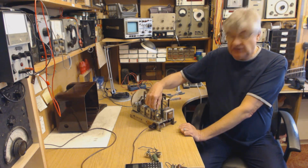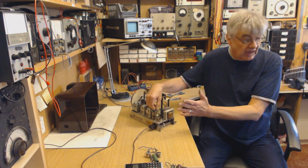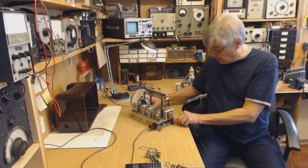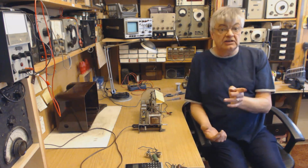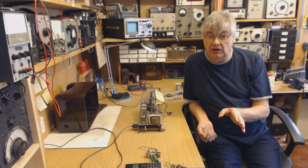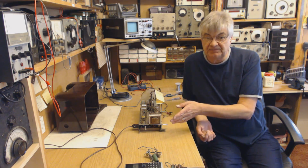So okay, there's another problem. The UL41, you know, the UL41 that all the DAC90As have, and they often have a problem with hum. Well, I found an EL41, okay, 6.3 volt heater, same valve. One slight problem, pin 4 I believe it is, I'll go into this on the circuit in a while. Pin 4 on the UL41 was used as an anchor point for some resistors. Pin 4 on this is cathode and grid 3.